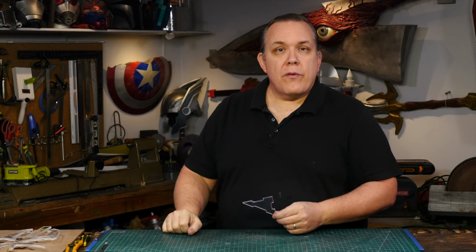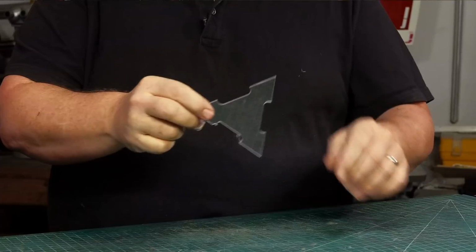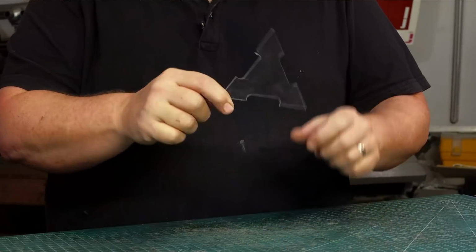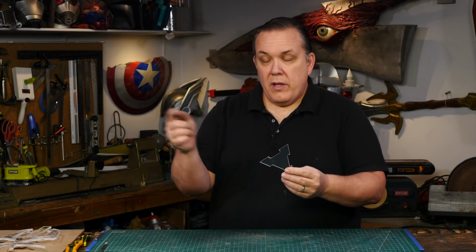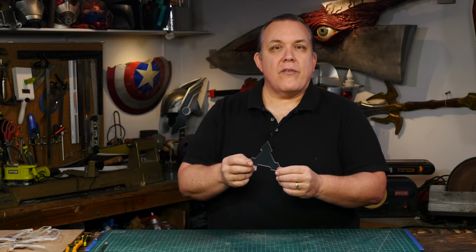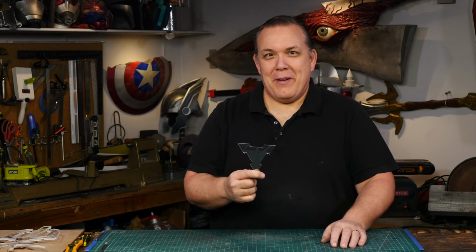So the piece I threw on the floor was this guy right here. This is the polycarbonate. I can't guarantee that it landed point down when it landed on the concrete, but all the corners are still there. If it was acrylic, there was a good chance that if it hit the concrete that they would have chipped, right? We would have gotten a fracture at one of the corners, but because it's polycarbonate, it's just fine. And this is why I like polycarbonate.